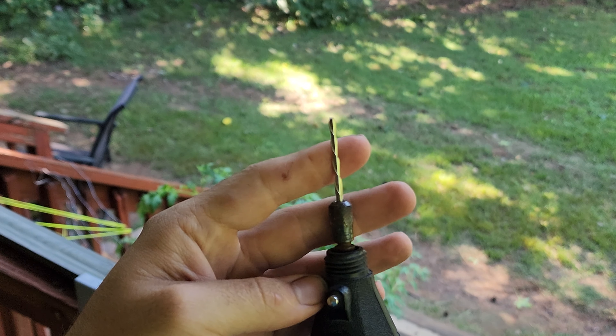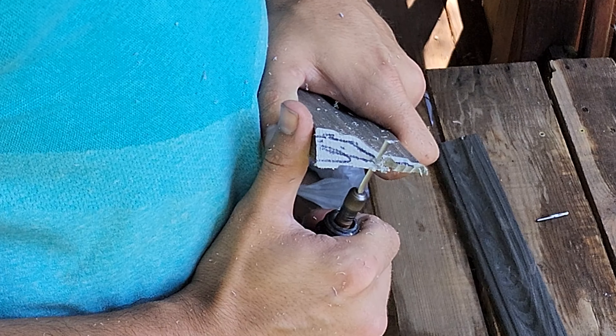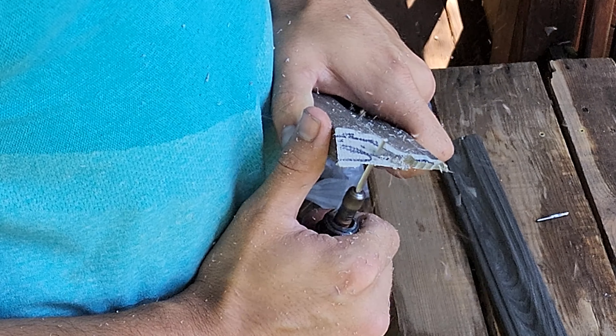To get a more precise cut, I use a rotary tool with a milling tip, which especially helps when dealing with trim that has little curves and details. I use this rotary tool to cut away the excess material, and here's a side-by-side comparison of what it's supposed to look like versus when you still have a little left to cut off.